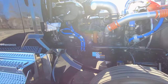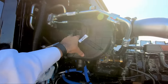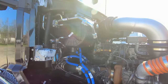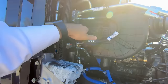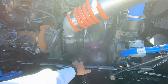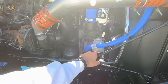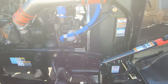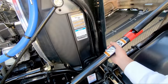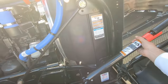So looking under the hot side of the engine here, we have the HVAC system right here. So this is the same HVAC that you would find on other 2.1 meter cabs with the filter right here, easy to change and replace. We have your oil filter and oil spinner, your centrifugal filter, your coolant filter right there. We've have a new design here. This is a little bit beefier, heavier duty design for the blowback cover.